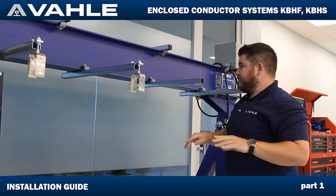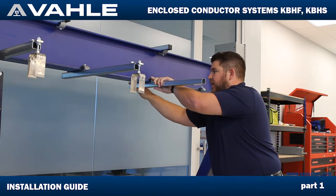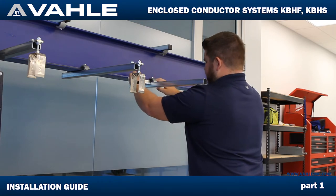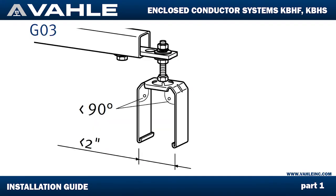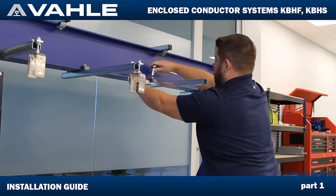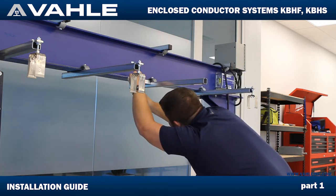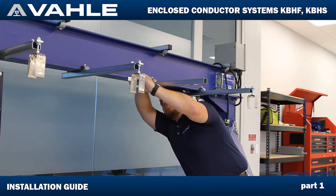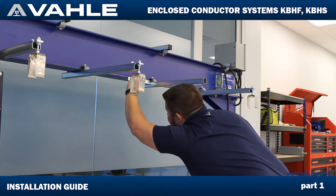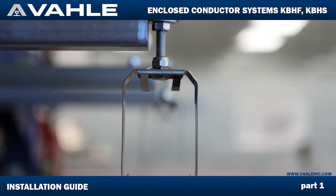Push the bolt all the way to the beam and then go ahead and snug it up — not too much, just enough to make sure it's not going to fall off. Line it up. Then take your square, put it on the beam, look below, and make sure it's square. You could take your half inch socket and just snug up the front. Check it again — that back side movement over just a bit. Hook your head on this side of the beam. It's easier without a hard hat but we're in the office today. Check your square — the square is good. That way you know it's aimed correctly, and as you go the bar will have a nice clean straight finish once you're done.